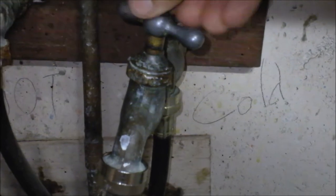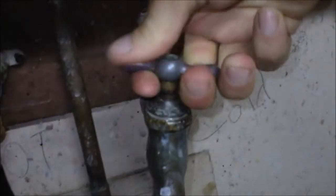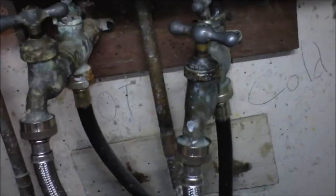Let's see what we get when we open up this thing. This screw is just holding the handle onto the keyed shaft that it's supposed to rotate, so it's probably tapered a little. I opened this up last night but tightened it back down enough so the taper grabbed again. I'll hit it gently with a wrench — not too hard, because I don't want to snap it off, but firm enough so it doesn't stay stuck.